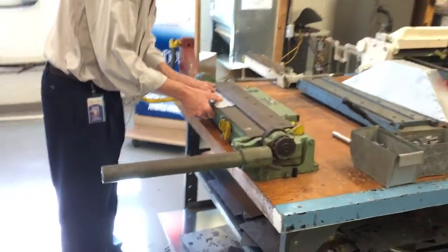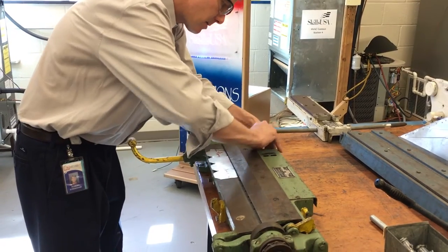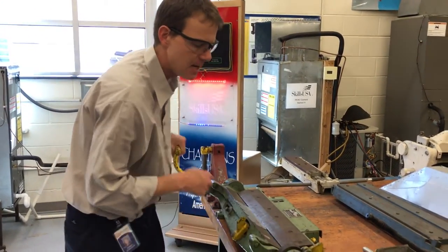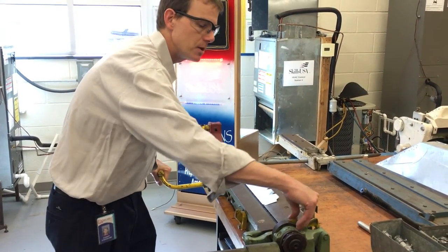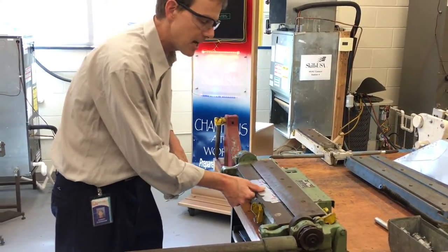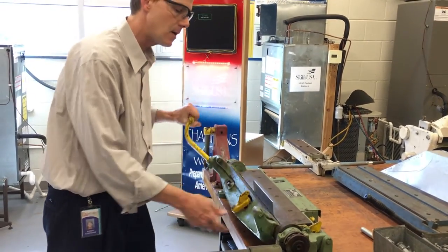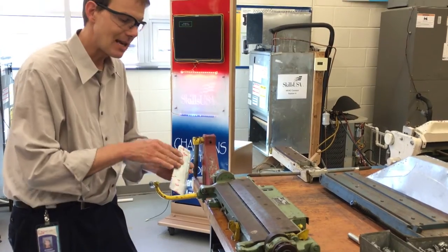So all you've got to do — I just need to adjust it a little bit back here. This one's going to go 180, and then I'm going to do a 90. It doesn't matter which one you do 180, which one's 90 — it can be either one. It's going to come all the way up. If it doesn't come all the way up, there could be a stop in the side that keeps it from going. So what I want to do for a 90: we're going to actually squeeze it down, put it back in there, and just raise up a little bit to get that hem to fold tight up against without bending the metal. Now we've got a smooth edge there. And then this one's a 90 — you can bend 90, or you can put the 90 stop and it should stop you right at about 90. Note how it springs back a little bit, so you actually have to go about 5 to 10 degrees over to get it to do the bend straight.